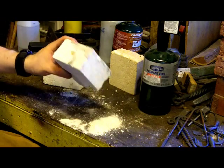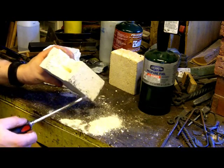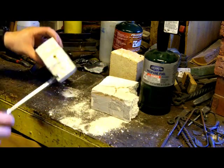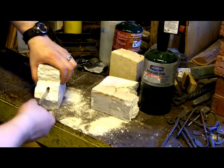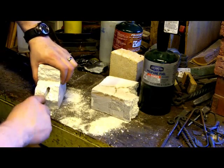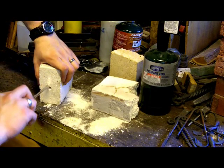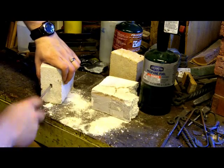That's kind of okay because we wanted a smaller opening and less depth — we really just wanted the burner port to be an inch or so from the end. However, where the brick just completely crumbles, that doesn't work. Again, this is a recycled brick — it's had several heat cycles on it. They build up stresses inside. The original fire brick forge over there has wire wrapped around the outside specifically to prevent this sort of cracking and breaking because it does happen. So not surprised, we'll just keep using this one.